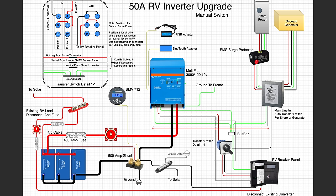If it's easier, you can put a bus bar on the shunt's load side. Solar would connect here, as would the existing wire that previously connected to the negative of the battery bank going to the breaker panel, so the DC side functions properly. On the positive side, existing connections that were on the battery bank before can connect here too. A bus bar keeps things clean and provides more connection points. The existing disconnect and fuse that were already on the RV — that wire was connected to the battery bank before and now goes on this bus bar so everything continues to work.